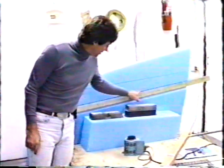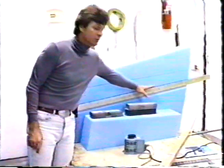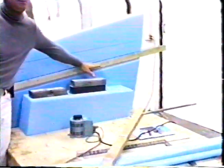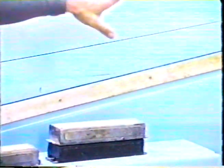And this reduces work for you, but it also provides you, in one particular area and one area only, a need to cut through an epoxy bond line where you need to remove the leading edge from the shear web area. So what it forces us to do is hot wire to the bond line from one direction, pull the hot wire out, and hot wire to the bond line from the other direction, or we could hot wire to the bond line and remove the hot wire unit in a way that doesn't burn away excess foam.